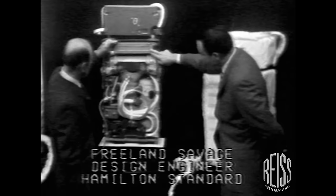The radio, actually, Peter, is the small box on the very top that runs from here to here. That is the communication system. The box we're looking at right here, this flange, is the heat exchanger. You've probably heard it referred to as the sublimator, which is what actually rejects all of the heat of this system to the vacuum of space.